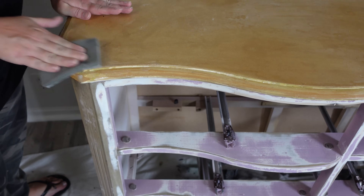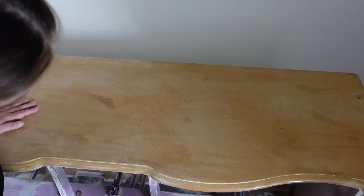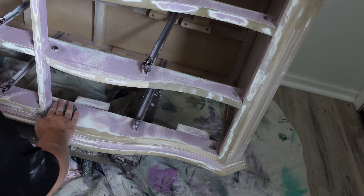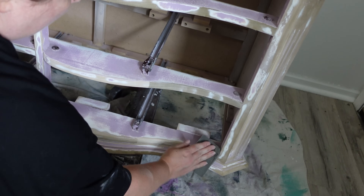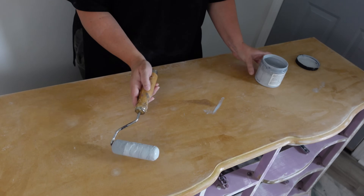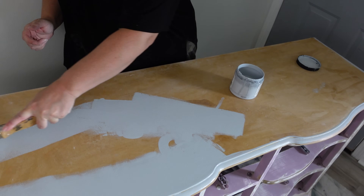Here's the next day. I start by sanding the piece. Yes, it has shellac on it, but I want to give it a nice sanding because I want my finish to be as smooth as possible. Sanding between coats isn't always necessary — honestly, it depends on what paint you're using and the condition of your piece; you have to make your own judgments. But I am vacuuming, sanding, and cleaning — doing all the things again. Prep work is key to a beautiful piece. If the piece looks like garbage underneath your paint, it's going to look like garbage once you put the paint on.